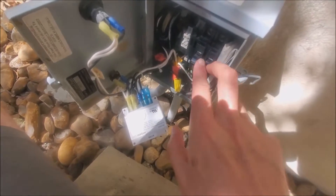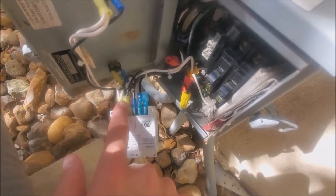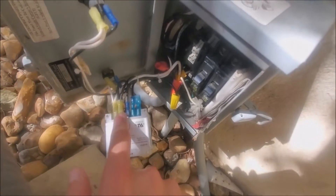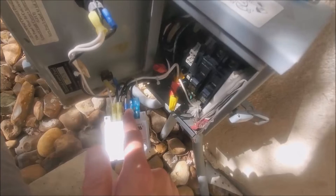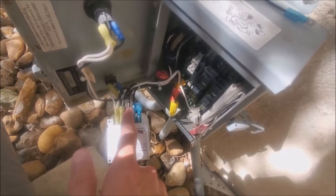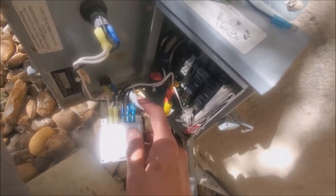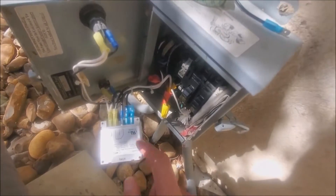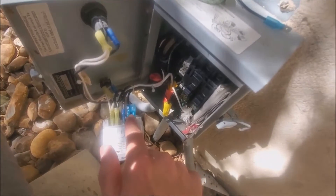I got my new timer. I shut off the power and got it hooked up. Let me go over the wiring one more time. This is the neutral and hot input to the timer. This hot is jumped over to the switch, so when the timer goes off — when you want the pump to operate — the switch will switch from here to here. That line energizes your submersible pump to pump out the water in your aerobic system. There's a very good safety reason to have this terminal cover on here: this leg is actually hot when the timer is not spraying. Make sure you replace that piece even though there are no wires connected to it, because there will be 120 volts on that line.